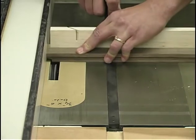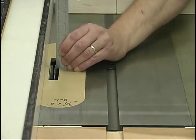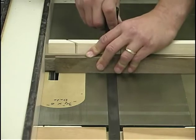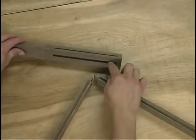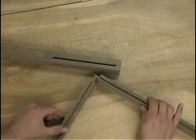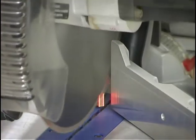Make an adjustment to the height, take the end cut, make an adjustment to the height, take the other face cut, make an adjustment to the height, and then take our other edge cut — so it will require four setups. Where the two rails meet together inside the mortises of the leg, we need to miter that end cut there to provide clearance to allow them to come together. The compound miter saw makes this a very easy task.